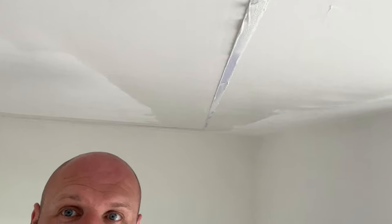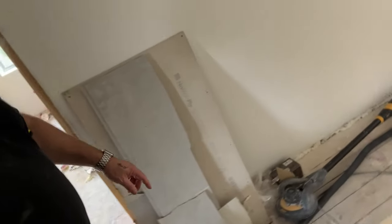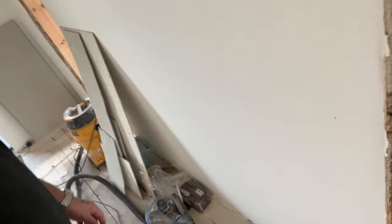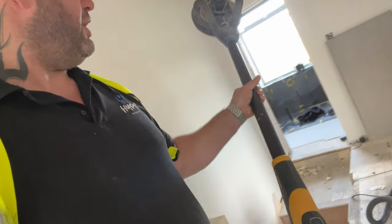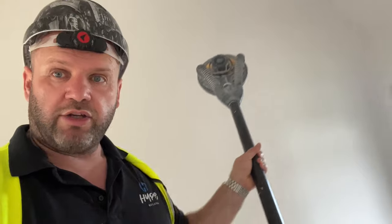Here's the machine that does it. So you can see it's just been flatted out there. Once it's had two coats and it's been dried — it only takes two days — we then use the sander on a pole, like so. It's quite a light thing, and we literally just run that over the wall and sand it. That's what gives us a finish. Spray plastering, folks.